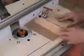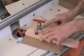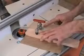Set up for end grain cuts by installing cutter number one in your router table and locking a test piece in the coping sled. Bring the test piece up against the router bit. Notice that the end grain cut produces a lip on the front of the door frame and a shoulder on the back. The shoulder should be about twice as big as the lip.